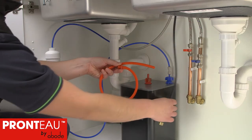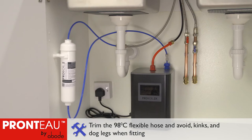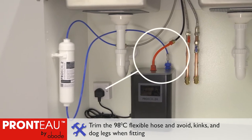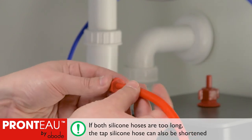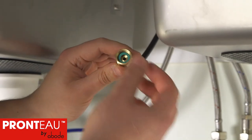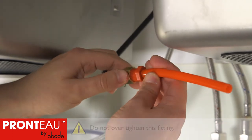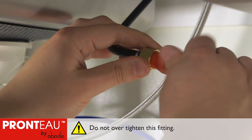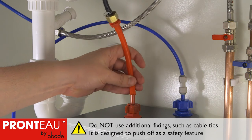It's very important to only use the silicone hose to attach the red boiler output to the flexible hose D1. Measure out the minimum length needed, add 50mm, and cut the silicone pipe cleanly and squarely. Push the silicone hose first onto the red connector. Insert the fibre washer into the brass connector on hose D1, fit the red adapter and tighten with spanners — don't over tighten. Then push onto the boiler's red outlet.